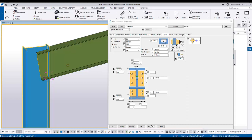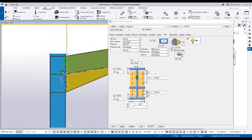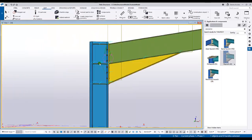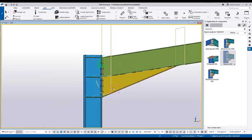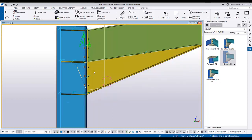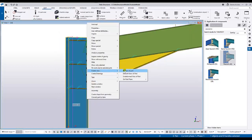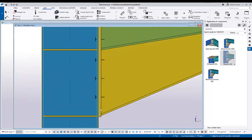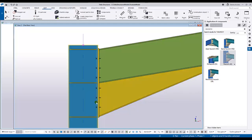Pick the main part which is the column, then pick the rafter or beam, and there you have the rafter connection with the haunch. However, the requirement from our inquiry includes stiffeners that are not available in this particular connection component. So I'm going to use another component for the stiffener. I'll create a 3D view so I can have the elevation. From this elevation, I'll add stiffeners at several positions, with four stiffeners on the left side, and then copy to the right.